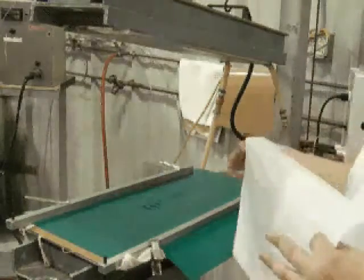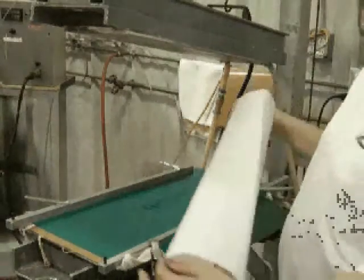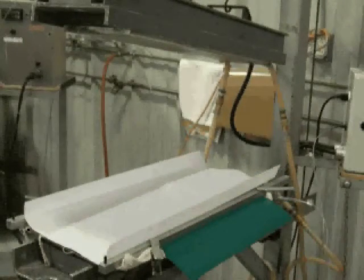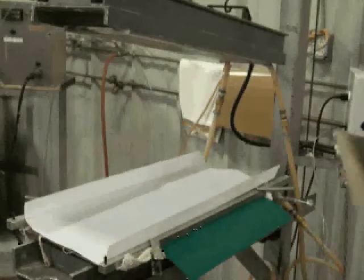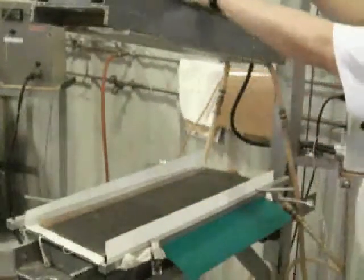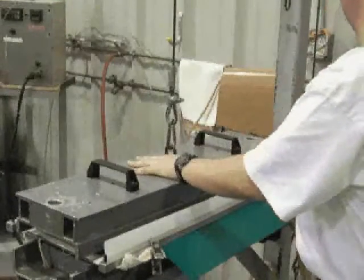We finished the build by installing silicone impregnated paper. For this particular belt, it uses silicone paper because we want a matte finish. Teflon can be used for a glossier finish. And the manufacturer's joining instructions require just a heat plate if they do not require molten cloth. Then lower the lid and use either your clamps or screws to hold it down.